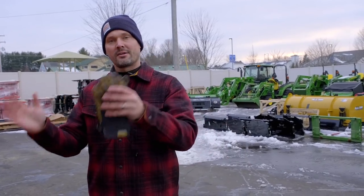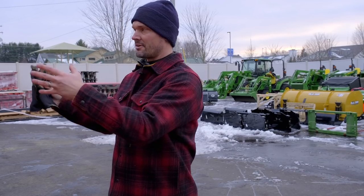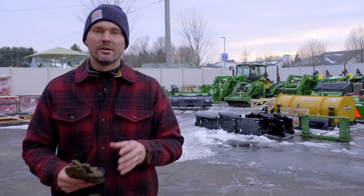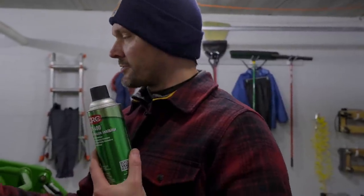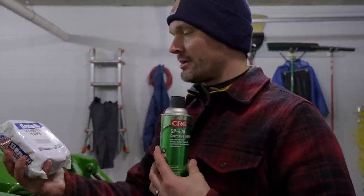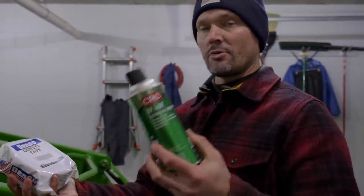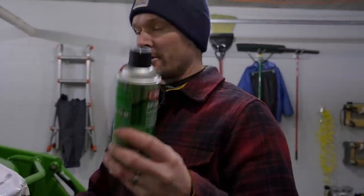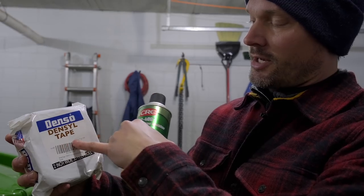In the course of research, there were a couple of products out there designed to protect cylinders like this, or even exposed fittings. If you have exposed fittings on your tractor in a harsh environment, this could be a good solution to keep them from corroding over time. So these are the couple of products right here that seem highly recommended by a lot of different hydraulic websites. One is a spray formula, and this one right here is tape — Denso tape, as it's called. You can also buy a grease or waxy grease to put underneath it and then apply the tape over top.